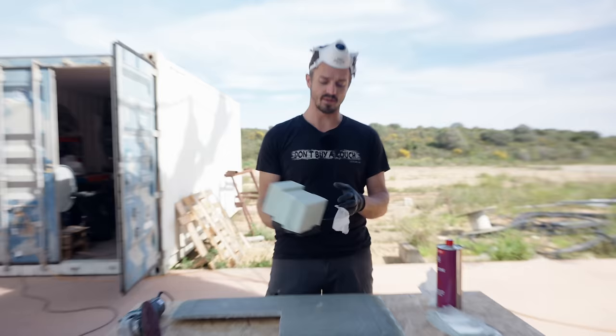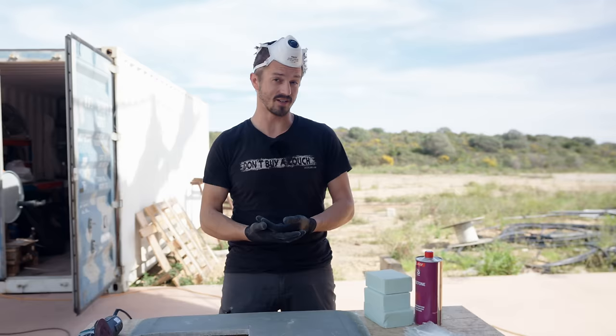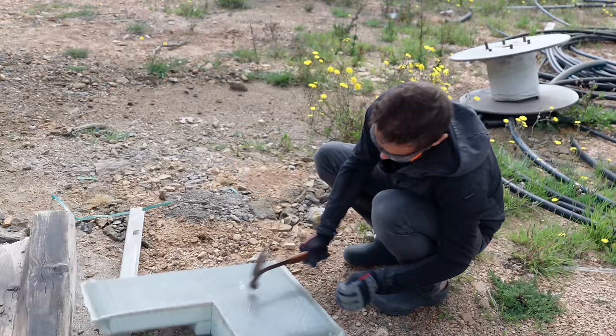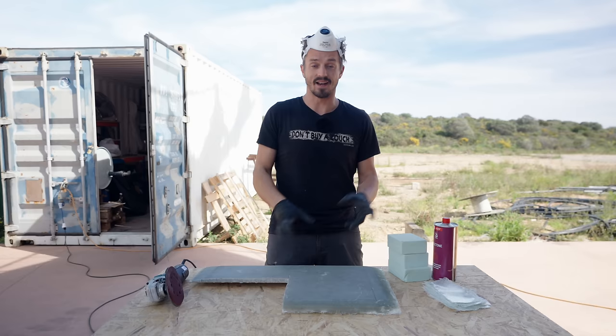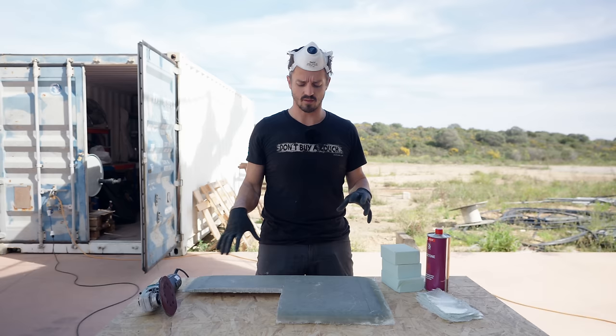We've got three little pieces of foam we're going to glue on. This isn't a structural test — it's a bonding lamination test. Once we cut open our original sample, the structure had diminished significantly, but the fact that it popped off in one clean sheet meant there's some issue between the bonding of those two layers. We didn't see that between the rib and stringer layers — those bonded really well. We're trying to figure out what went wrong so we don't repeat it. Inside the boat, it should tear and rip and shred — it shouldn't just pop off in a nice clean sheet.